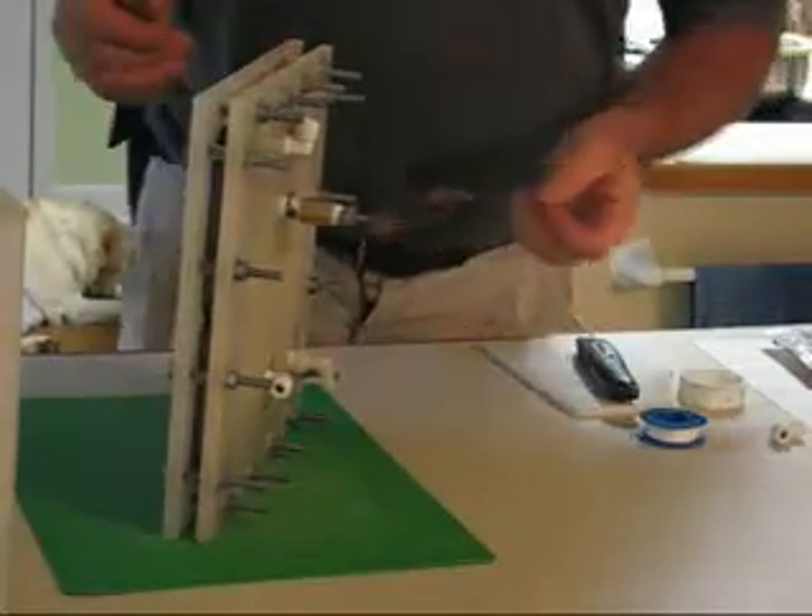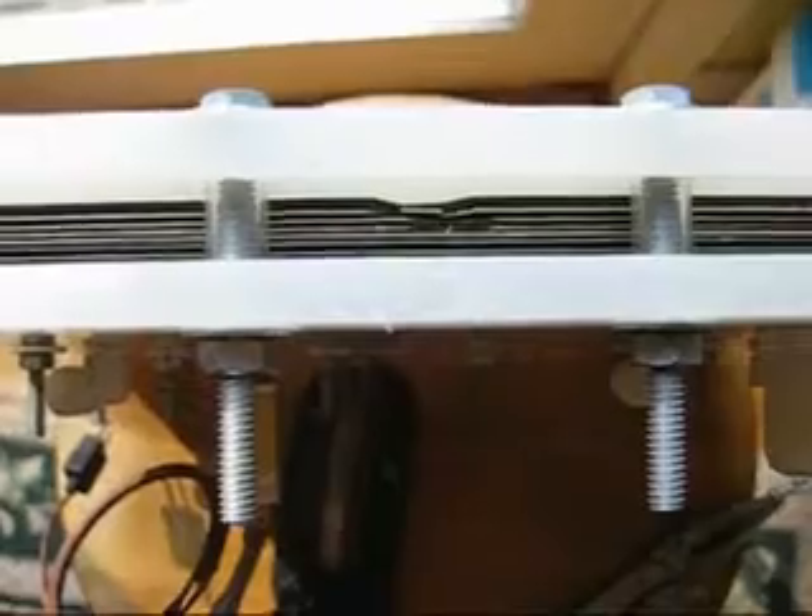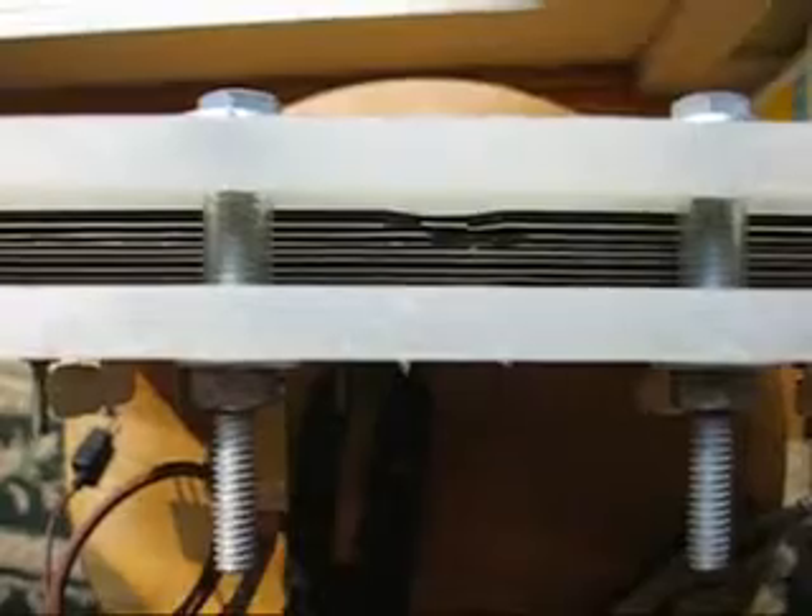But I'll be able to tell if it catches on fire. I just have to tighten that down. Testing will begin tomorrow. Ran into a problem here — clearances are so tight, it's real hard to work in this. I was checking to make sure there's no shorts, but you can see that the cutout next to my tab is offset. The terminal is going to short. I'll put the terminal on here — you can see that terminal is going to touch one of the neutral plates. So I've got to take it apart and grind that out.